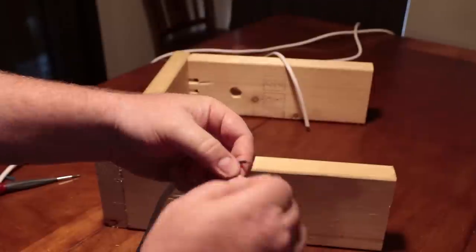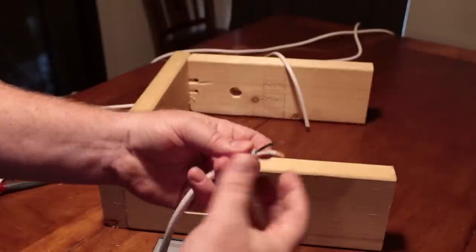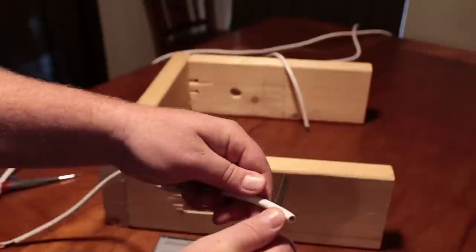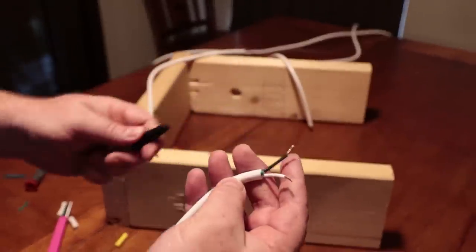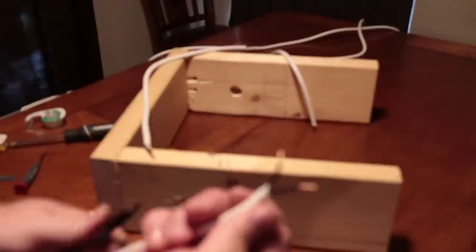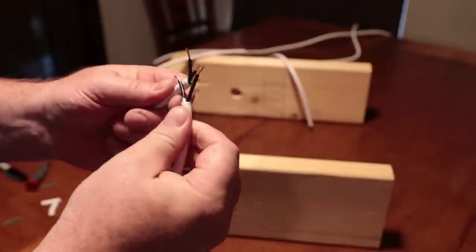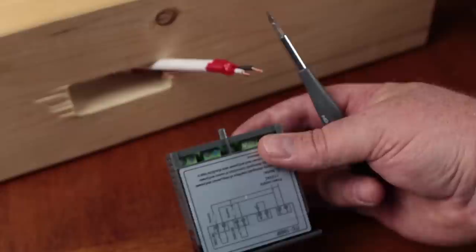You can put some tape over the ground wires if you don't like exposed conductors. Strip the power cord wires back about a quarter of an inch so they fit into the ITC terminals. On the cooling side, I'm using both the white and black conductors since they're just connected to a switch. To avoid confusion, strip all the outer shielding, prep the wires, and use a sharpie to color the white wire black so there's no confusion on the cooling circuit.